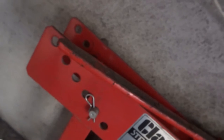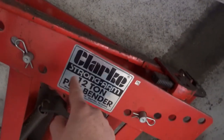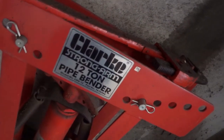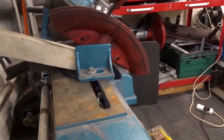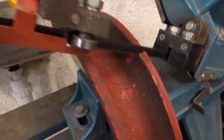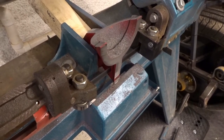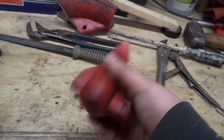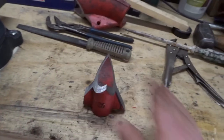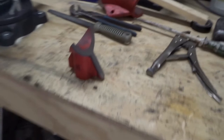This gap here from here to here is just under 10 centimeters, which is just enough for what I want to do — I can squeeze my piece of plate in between the two pins. I probably won't use the rollers. If I've got a wedge-shaped pointy thing acting upwards, hopefully it'll bend with a reasonably tight crease, not a gradual curve, which is not what I want. It's not pretty and it's not subtle, but I think that should be capable of putting two bends of about 25 degrees into two pieces of six millimetre thick plate.